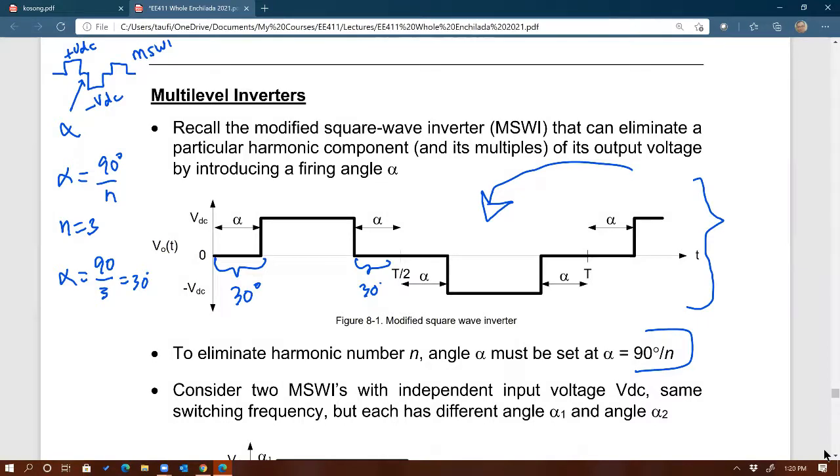For this one, it's going to be quite the opposite. You're going to need heavy filtering for this because the harmonics are going to be very close to 60 hertz. Whereas PWM, the harmonics are located away. Oh, they're further. Okay. Right. Yes. That's loss. What do you mean by loss? Like they're more efficient. No, they're not more efficient, but this type of inverter has better loss in terms of, blank. Yeah, I'm not going to give you the answer. It has more loss because of harmonics, but actually compared to PWM, it has less loss with respect to, but there are different types of losses, right?